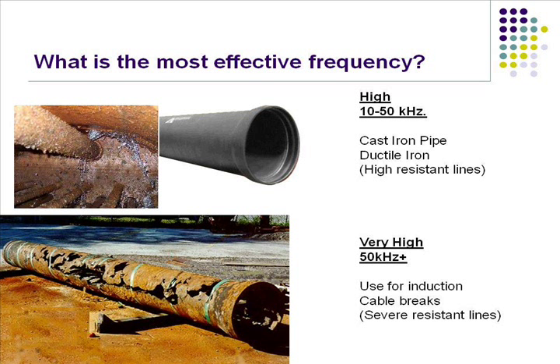So if you hook onto this line or even a regular cast iron line, your signal's going to have a hard time. It's a very, very bad conductor — electricity has a hard time traveling down it. So what happens is it just gets off that conductor and gets back to that ground rod on the transmitter to complete its circuit instead of traveling any distance down that conductor.